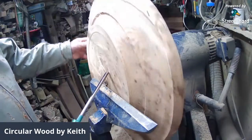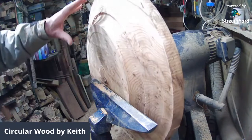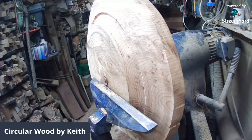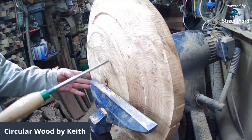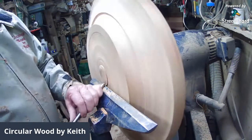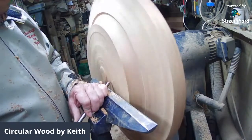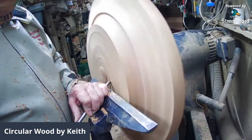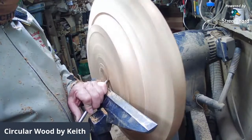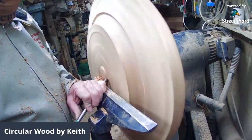Once you've stood there a few minutes you realize it's no different to sanding in the conventional clockwise way - it's not a problem. For those who have used Union Graduates at school or universities - the Union Graduate has a fixed head, so you turned up to about 12 inches in spindle mode inboard. If you wanted to do anything bigger you'd put an external faceplate on which ran in anti-clockwise, because you were turning outside on a left-hand thread.